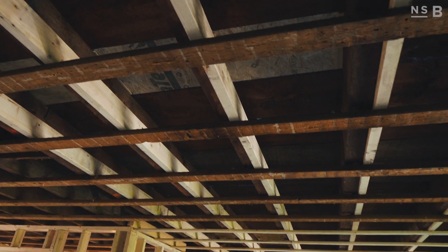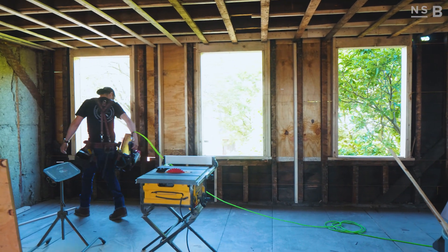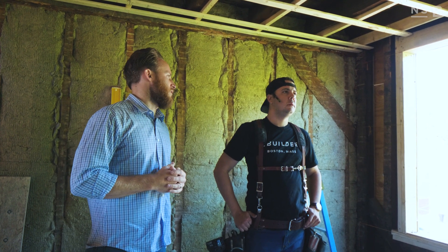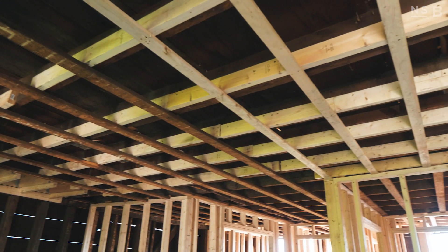With the client they're looking to do crown molding, possibly molding build-ups. Our windows were askew, and everything was going to look pretty choppy if we didn't take the time to flatten and level things. So walk me through the process as far as what we've done thus far with the ceiling. With the ceiling getting crowned, we want to flatten and level as best we could.